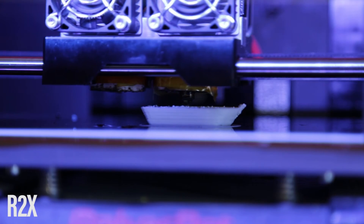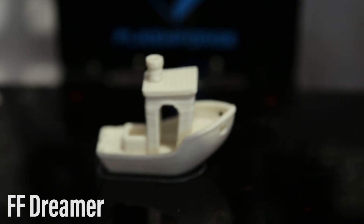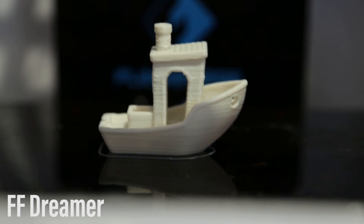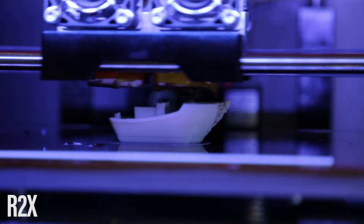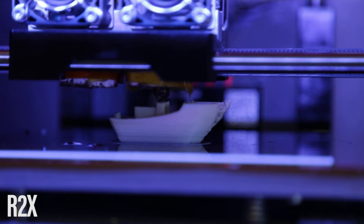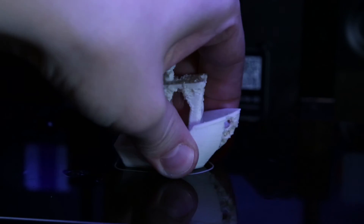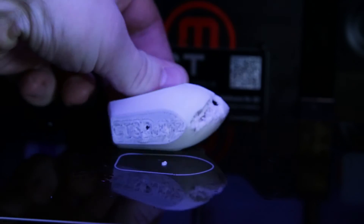The benchy on the Dreamer looks really good and I think I managed to get the settings correct. There's a little bit of stripes in the model and some over-extrusion, but it's looking good. On the Replicator 2X, some of the layers are okay, but the front doesn't really work — it seems to need a cooling fan. The Dreamer result is ready and looks pretty good, though there's a small heating or flow issue in the front that I can't quite figure out.